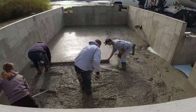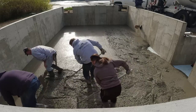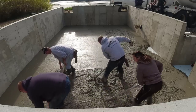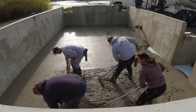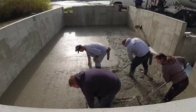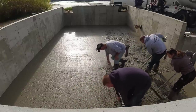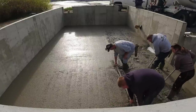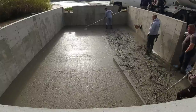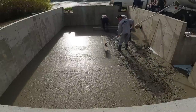You can see how we screed — I'm leaving a little bit of a line on the end when I screed. You can see that straight line coming down, and look over there on the left — Luke's doing the same thing, he left kind of a line in the pad. When we leave that line that means we're striking it off flat, or level, however you want to call it — no humps, no dips. If we really dug in you could tell. If we didn't leave that line, that means we're not striking it down on the pad, which would leave you a hump. You can see I'm doing my own one-handed screeding right there — you know you're old when you just screed with one hand.